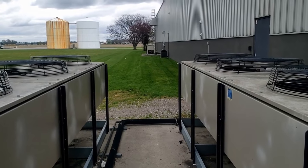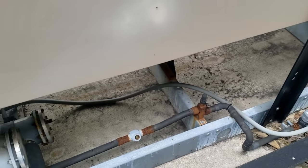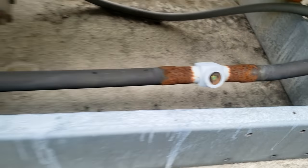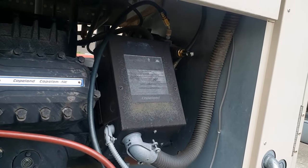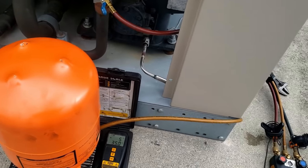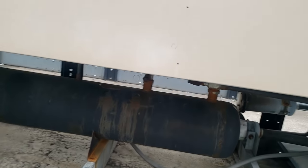All right, we're back. I got the motor changed down there — so that's the number two motor. And right now we're adding some refrigerant to this one here. You can see she looks like she's a little over there. So I'm going to check these canisters — definitely you can see the oil, it might be old. But we're hooked on there and getting her in. She's starting to sound a little mad — it's going to look a little low too.